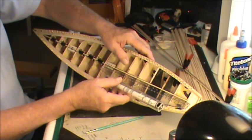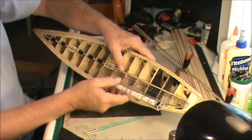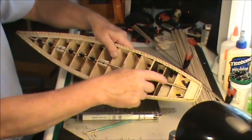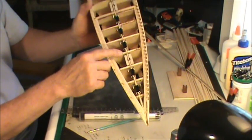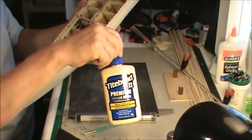Now when you lay this first one down, because the ship is kind of bowed in the center, you have to push this down and clamp it down. The plank has a tendency to drift to one side or the other. So I took a ruler, and when I got that first one down I made sure that plank was nice and straight. As I was putting clamps on I was checking it constantly — make sure I didn't lose that nice straight line. Using my Titebond.